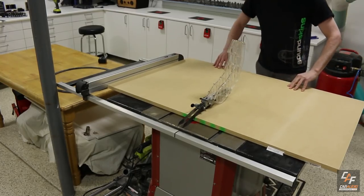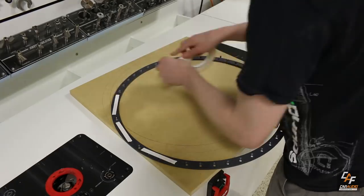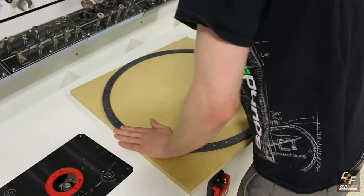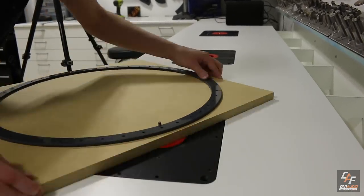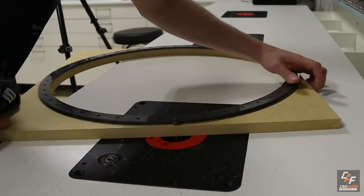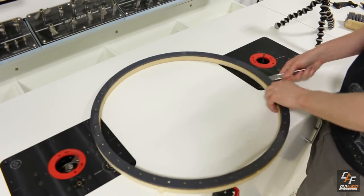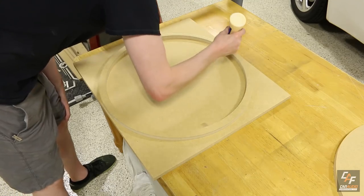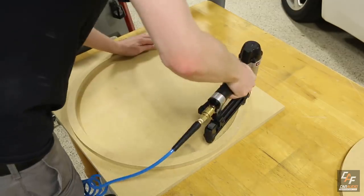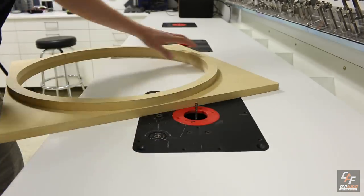Now that I've traced the outline of the large circle onto the material I'm cutting it down to size using the table saw so it's more manageable on the router. I apply double-sided template tape to the back side of the template, remove the backing paper, and stick the template onto the board. I then copy the template shape using a quarter inch spiral flush trim bit. I provide a list of tools and materials in the video description. This circle is my first layer and now I attach it to a new layer of wood, using wood glue and brad nails since these two pieces will be permanently attached.